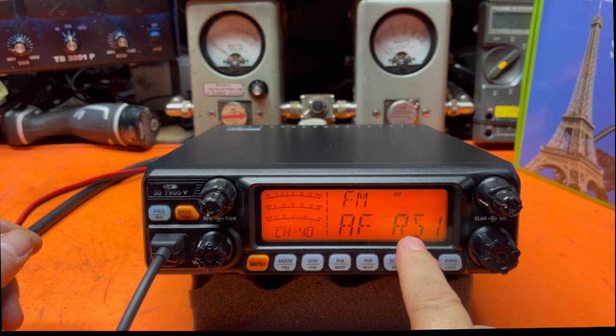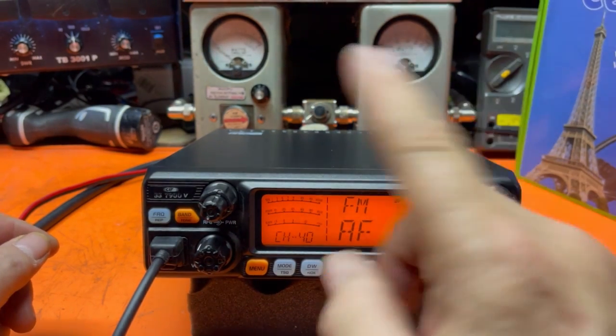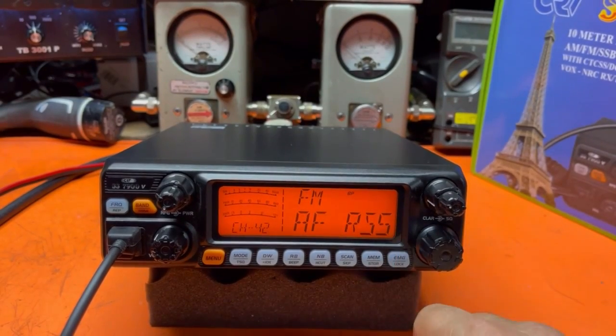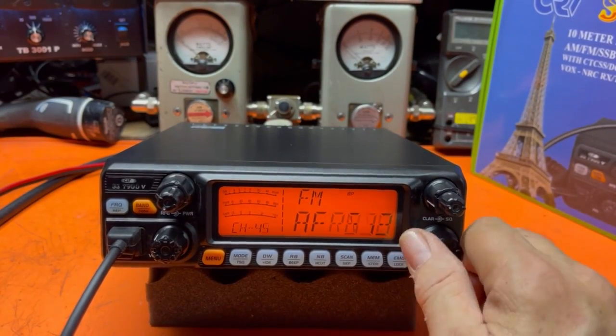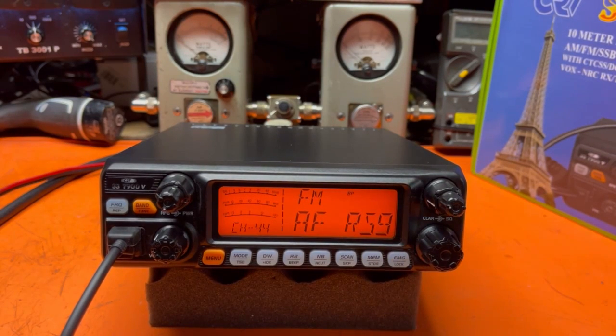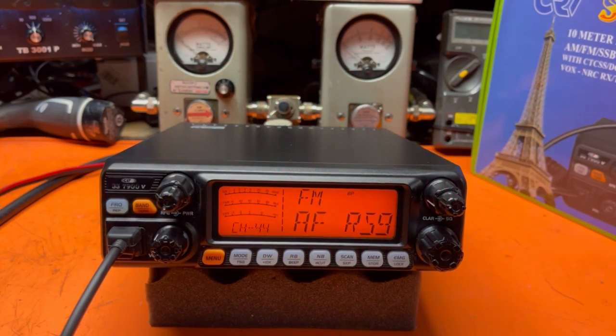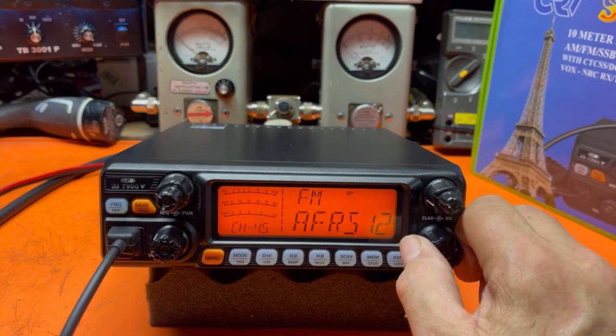I love this part the best — check this out. This is AM FM S1. I get to inject an exact S1 from that equipment there. I can inject an S1, S3, S5, S7, S9. One through nine works out to where it's the most accurate S meter you'll ever see. Every other radio over the years has set it to S9 and wherever the rest land, that's what it is — nothing you can do about it. Well, now you can. Every increment calibrated accurately. Pretty cool.